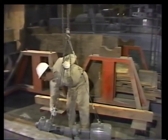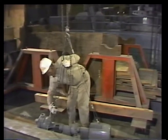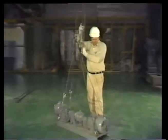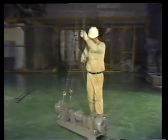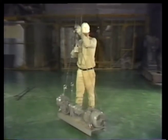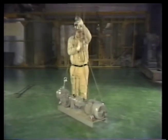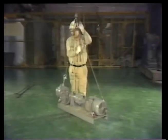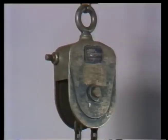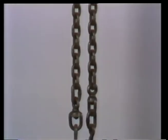While Norris completes his balancing act, let's consider some of the other possible techniques for rigging the same load. Here's one alternative. He could have used 4 slings instead of 3. Except for the extra equipment, 4 legs are no different than 3, as long as 2 turnbuckles are included for balancing the load. However, turnbuckles aren't the only way to adjust the length of a sling. He could use a load leveler. The lengths of each leg can be adjusted to change the position of the load hook.